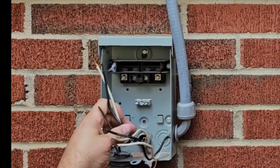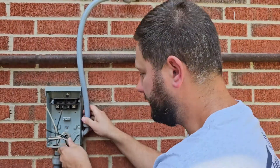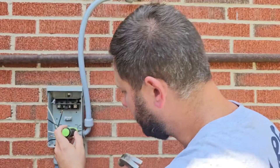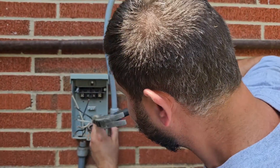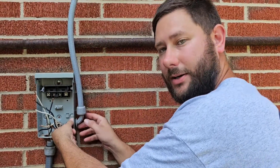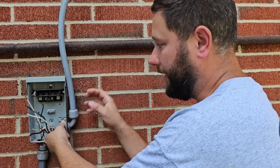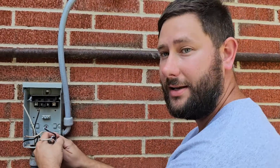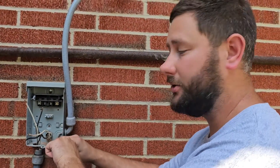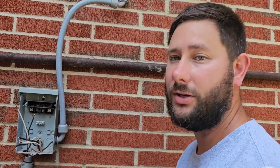You've got to straighten these wires up the best you can, and be careful not to scratch the wire. Once you get the lock nuts off, you can straighten the wires up and pull the conduit fitting out of the disconnect. Make sure you follow your local code. If you need to use stranded wire, use stranded wire. If you need a certain type of conduit, use it. For exterior applications, you may need Schedule 80 gray PVC conduit or liquid type conduit — you may not be able to use Schedule 40. The ICM-495 is rated for outdoor or indoor installations.